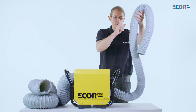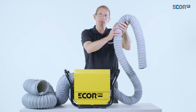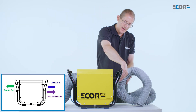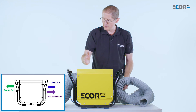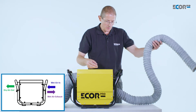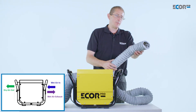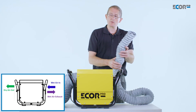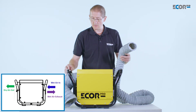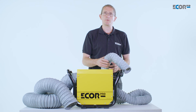Logically it would be better to keep this exhaust pipe short and keep the dry air outlets from this machine longer, because the dry air can be pumped a considerable distance and this exhaust cannot. This machine has only one driving fan, which takes air from the ambient in through the wheel, filters it, and blows the dry air out. A percentage of that drier air is turned back into the machine to dry the wheel and drive the humidity out. So this machine runs in balance with its inlets and outlets. If we restrict the air coming out of the exhaust, that's going to directly impact on the dry air outlet, reduce the drying effectiveness of the wheel, and significantly reduce the performance of the machine.